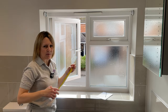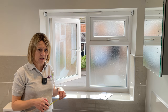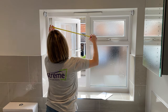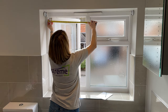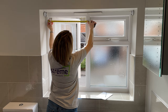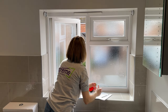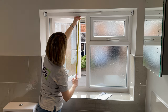I'm going to take my tape measure and take dimensions in millimeters, because that will give us the greatest accuracy and it's the measurement that we use on our website. First of all I'm going to do the width — including the bevel on the left over to the right — and that is 546. I'll just note that down, and then again on the height including the bevel here at the top.